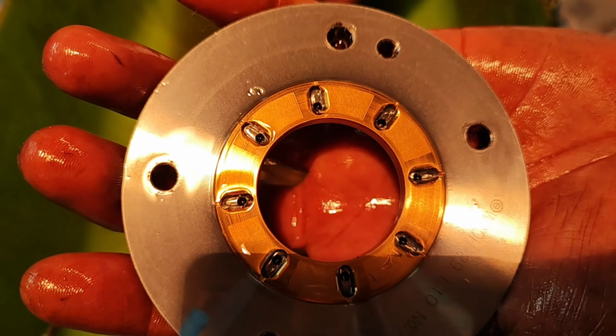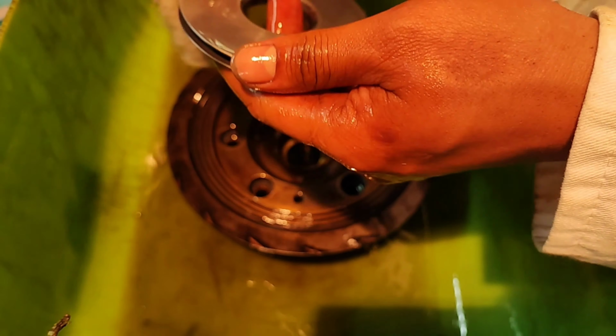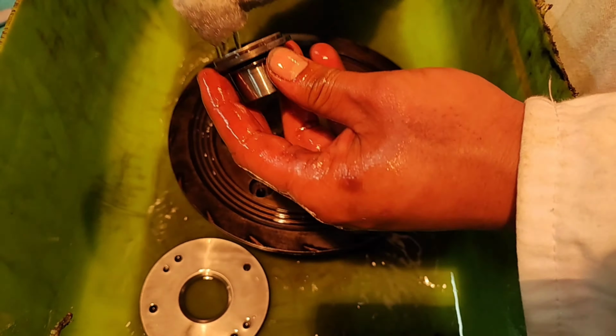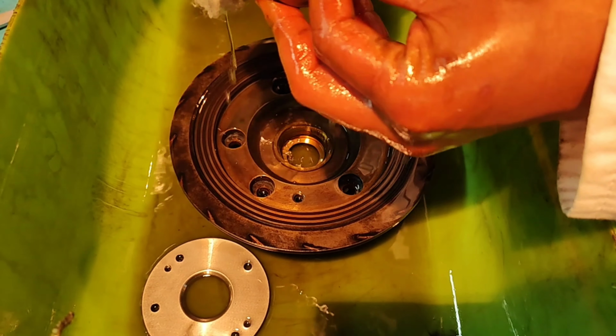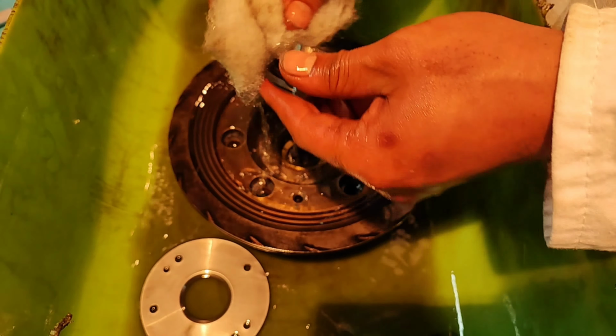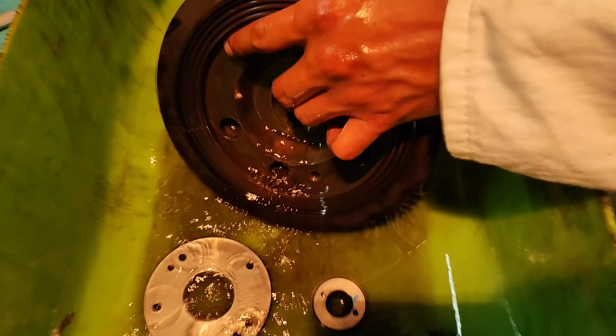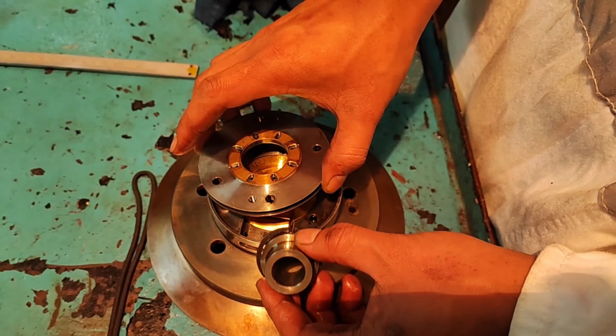Thrust bearings are the tapered land type, consisting of a tapered part and a flat part. Oil is pulled into the wedge-shaped opening formed between the thrust collar and the tapered part of the bearing by means of the rotating action of the thrust collar, thus creating oil pressure that supports the thrust load. When the thrust bearing becomes worn, the ratio occupied by the flat part increases.